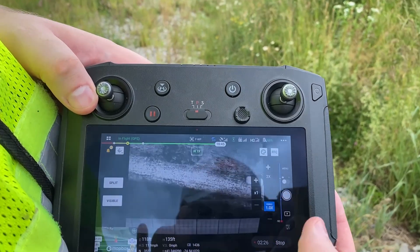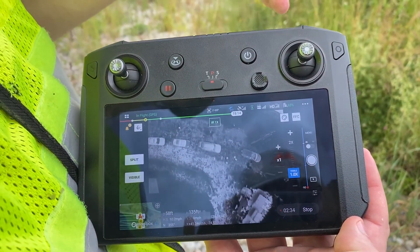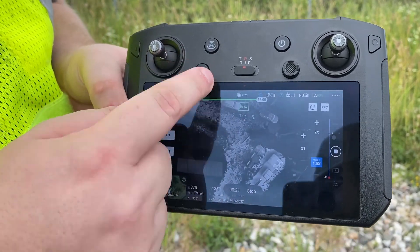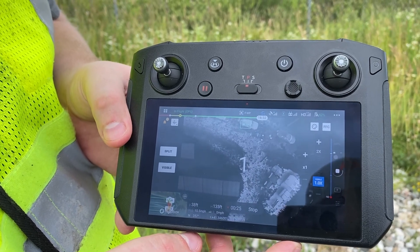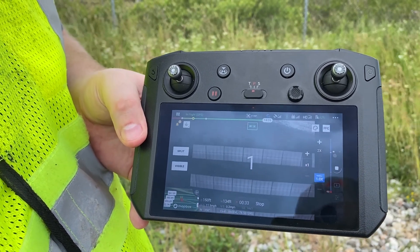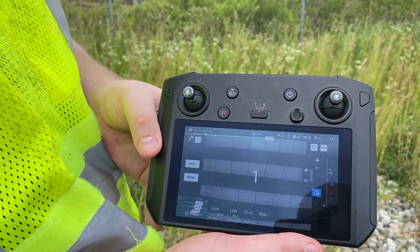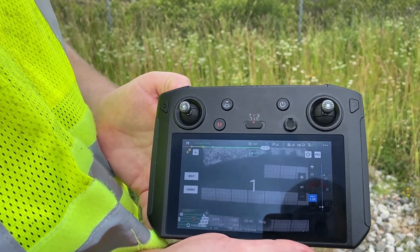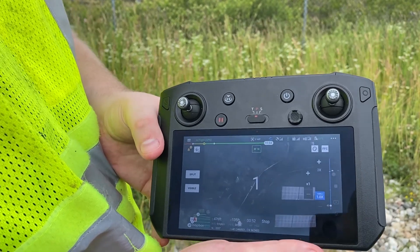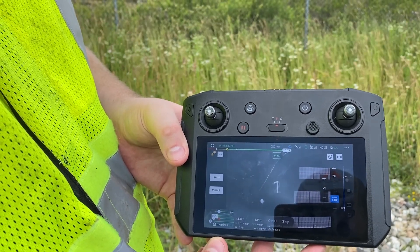Heading to the next waypoint — we're already lined up with the panels, the camera angle is down, and we're starting the intervalometer. Unpause the mission and the aircraft will follow from waypoint to waypoint. All you have to do is make sure the camera remains correctly left and right — there's no editing once it gets to the end of each row, it'll just maintain this the entire time. If you need to change the camera angle, use the roller wheel on the left side and it will literally stay there. I recommend not changing it during the flight though — make sure you have proper coverage and the correct camera angle before you start the inspection mission.